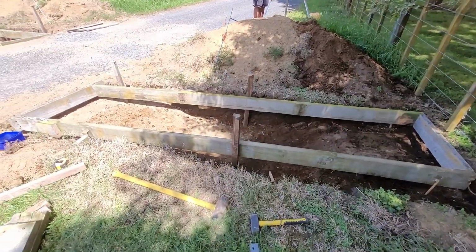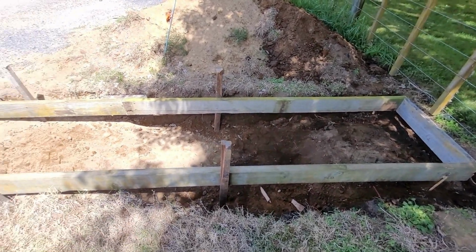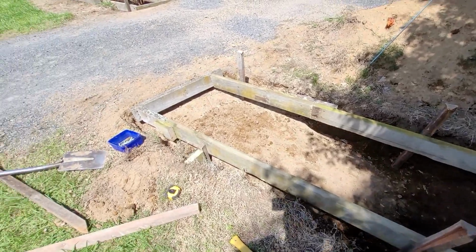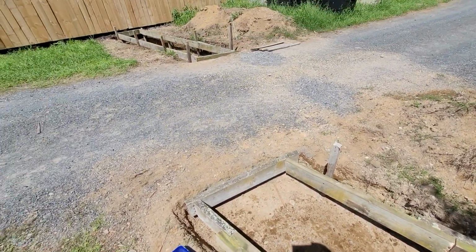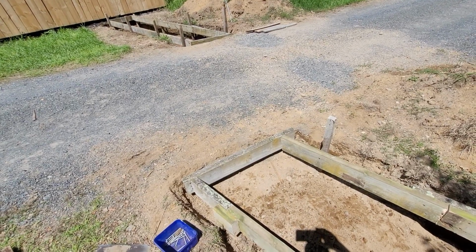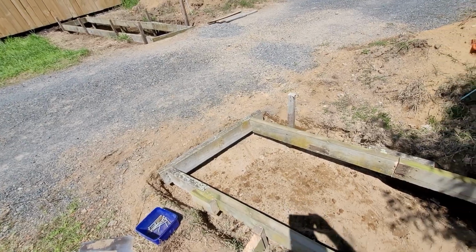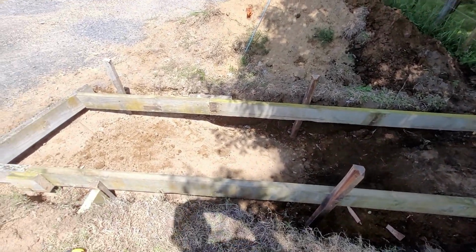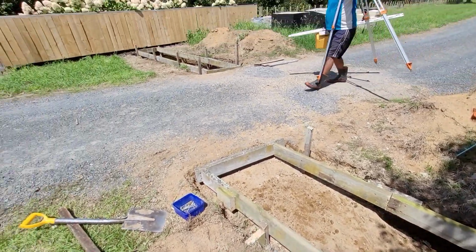So there we go, finished boxing around the top. Still a little bit of work to do. Next thing is I need to dig 2 post holes for the gates to go on. So I've got to put some aluminium poles in the ground, and they'll be concreted in the footing as well. And then once we've done that, a bit of pit sand backfilling, where it only needs to be 300 mil thick, deep, and then we're just about done.